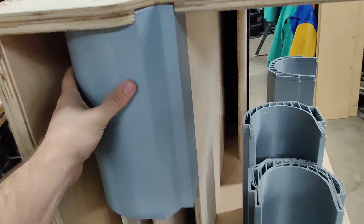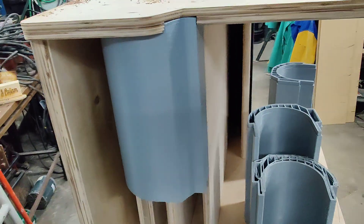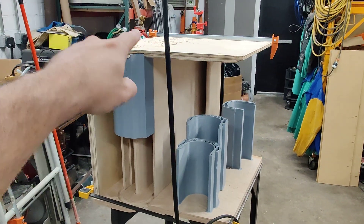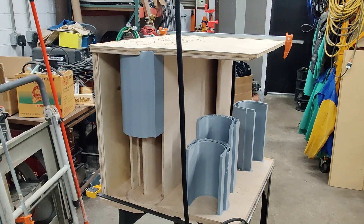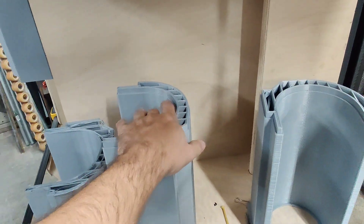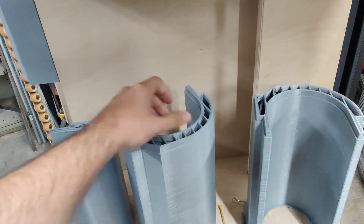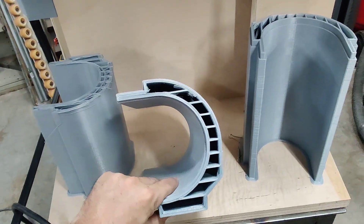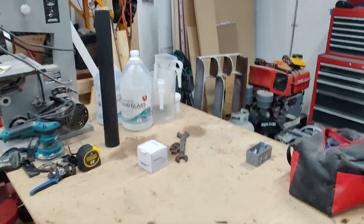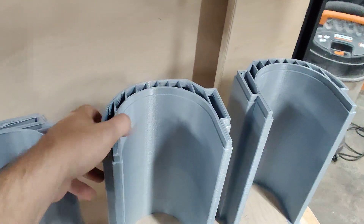When you're working with wood, in order to make a curve like this you've got to go through a whole lot of effort. 3D printing makes that a whole lot easier, but doing it right — because we're talking about a pretty decent sized piece — you've got to do it a certain way. This has to be ridiculously solid. Plastic alone can potentially be enough, but you'd spend a lot on plastic, so if we hollow it, it might not be enough. What we're doing is backfilling it with a liquid glass resin that's going to seep in and permeate.